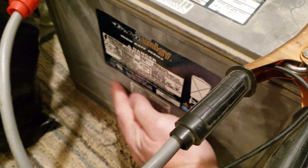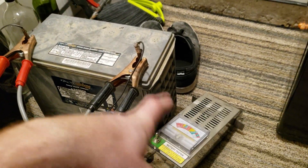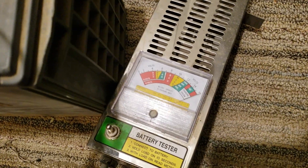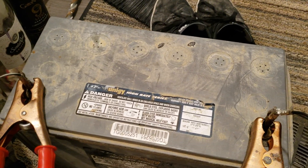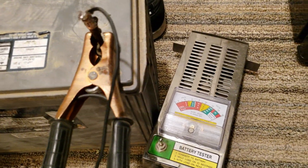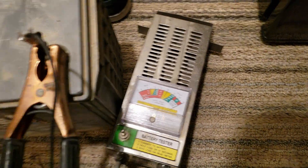There is a little bit of bulging in the cells on the front and on the back — you can see it just ever so slightly, it's not bad at all. This is a completely sealed battery. The only time it off-gases is if you push about 20 volts into it, which would obviously cause off-gassing because you're pushing so much into it — the valves can only take so much before they release. In this case, it's only 14.5 volts so this shouldn't be too bad. I'll be keeping an eye on it, and it's sitting on this rubber mat.